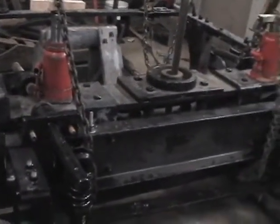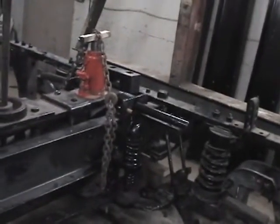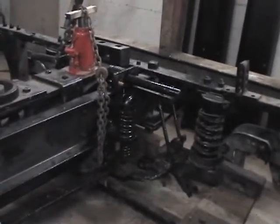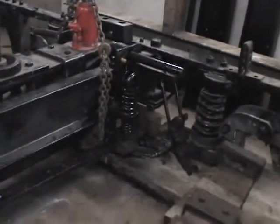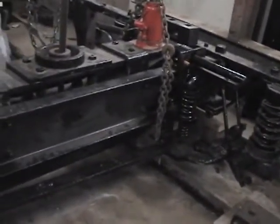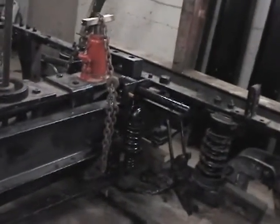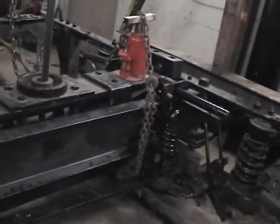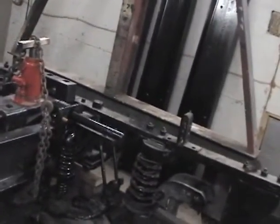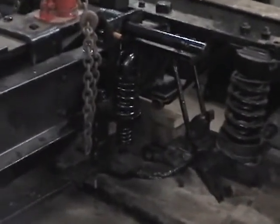The pair of springs — when the motor starts, it uses what they call the wheelbarrow mounting. What would be equivalent to the wheel of a wheelbarrow is where the axle is, and what would be like the handles on the wheelbarrow is where the springs are and that bar that goes across between the two springs. When the motor starts, it tries to flip up or flip down, so the springs cushion that and keep it from rotating all the way around, which wouldn't be very desirable.